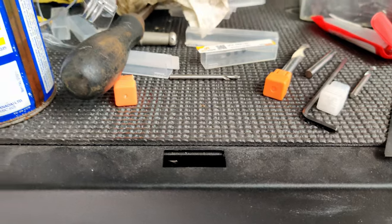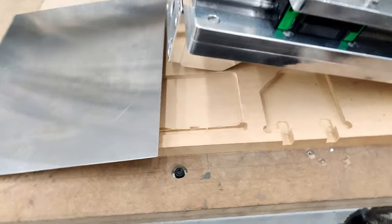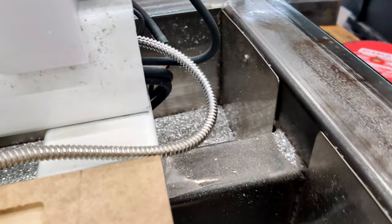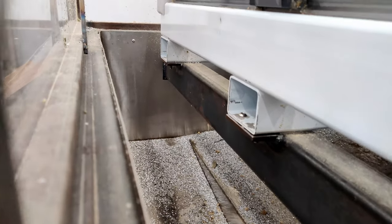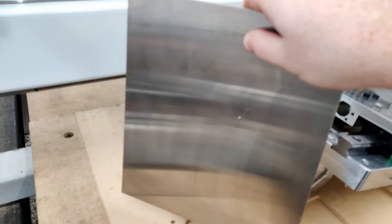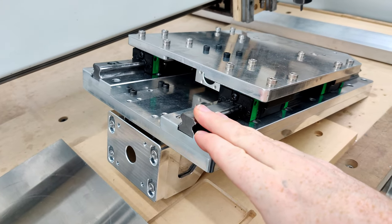I have a bunch of carbide drill bits, so they should make quick work of the stainless steel. Using the high-speed steel ones, I found, for instance, when I was doing these holes here, that's how the chip pan is held in, I must have used 5 to 6 high-speed steel drill bits just trying to go through that stuff. Stainless steel is really tough, and it just destroys anything that's not carbide. So that's where I am with this. I'll figure all this stuff out.